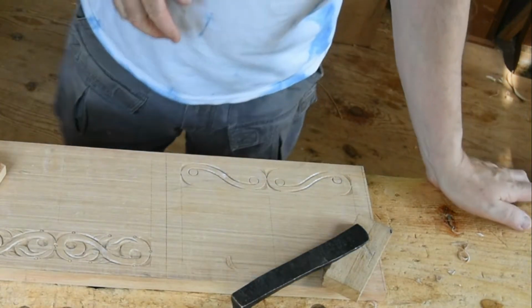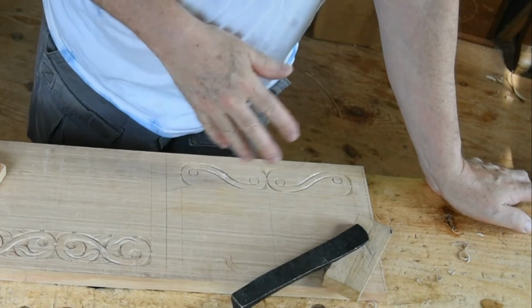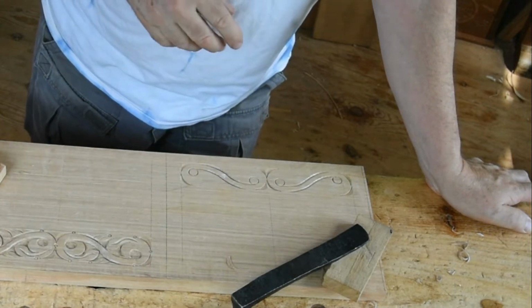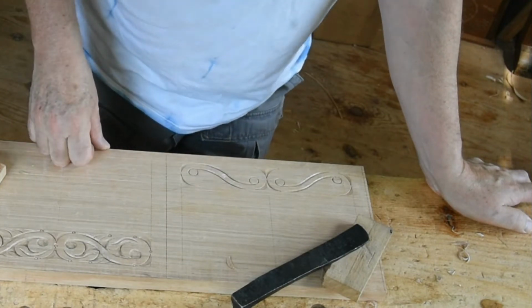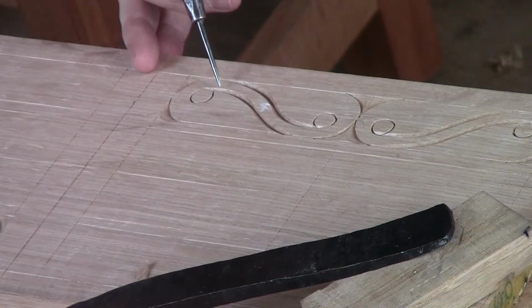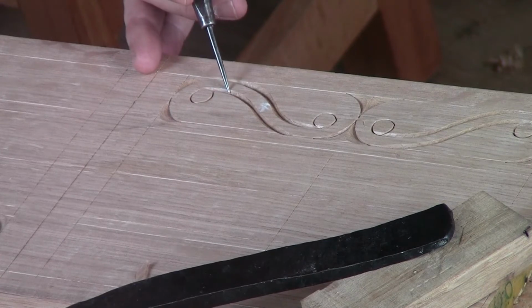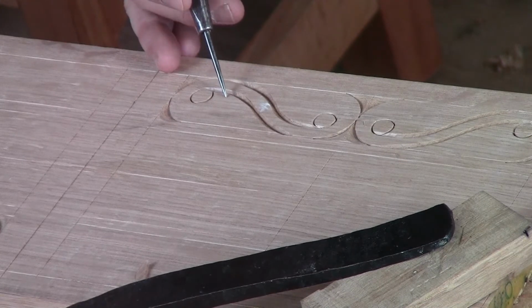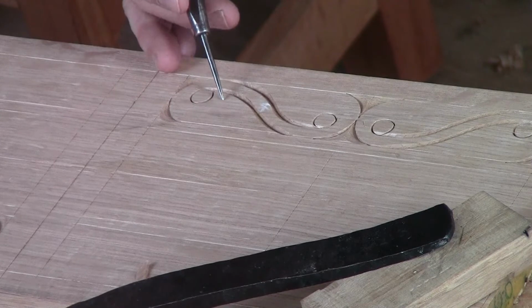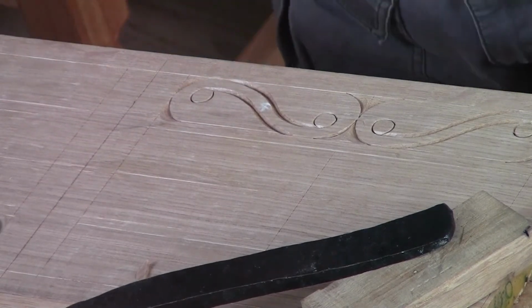Things you want to keep in mind are the flatter or straighter that line is, it looks dead. It needs a little bend, a little curve to it. And I don't start curving up right away from here. I come almost straight away for a blow or two of the mallet and then curve up. If it comes too quickly from here, you'll end up with a problem in the leaf that forms here afterwards. I'll show you when we get to that, which is now.